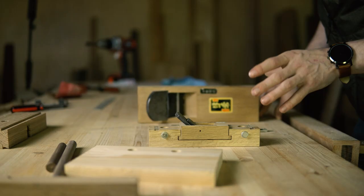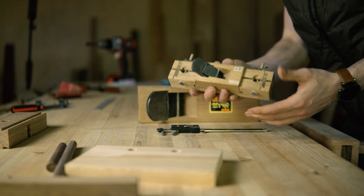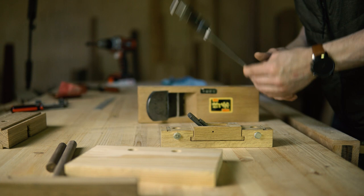Let's go over the hand tools that I use to actually do this. The most important tool — 100%, and you will see why later on — is the Mentori Kanna. This is a chamfer plane and it allows us to get really, really accurate results. We've got digital calipers, which are really, really important for accuracy here. You've got to have these — this is for anything you do in the shop. I think digital calipers are one of the most important tools.